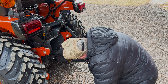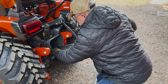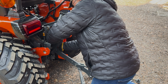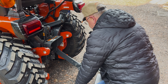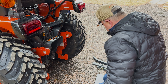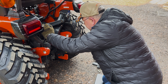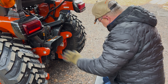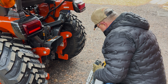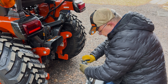I got the other side off, and we're just going to get this side off too. Always try to use gloves because there's still grease all over the place — the last thing you want is that grease all over your hands. I like to put the pins back in down here so I don't lose them. The top pins I just put right back where they're supposed to go. Always good to keep everything together as you take things apart — take photos so you can put it back together properly.